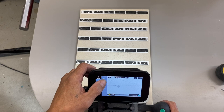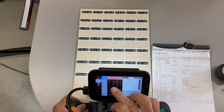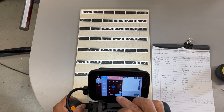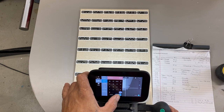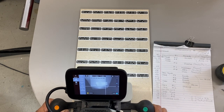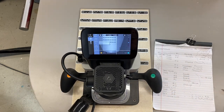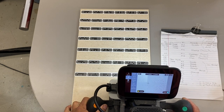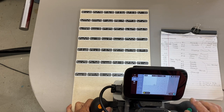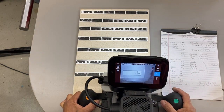This is where it gets fun. We're going into create mode and plugging in some parameters. Choose rectangle, grab my measurements — width is 8.25, and height measured right off the stone is 2.766, so I'll just plug that in. Another aspect of this machine I love is choosing an anchor point. You can see the nine choices; we're going to go with the lower right corner. Right there is inch and a half from that right edge — I can just bring it over until it pulls up 1.5. Inch and a half from each edge, and boom — push Place. It's in position. How cool is that?